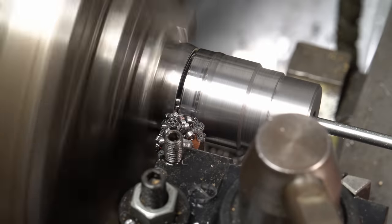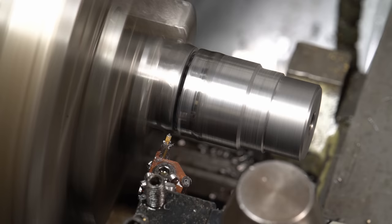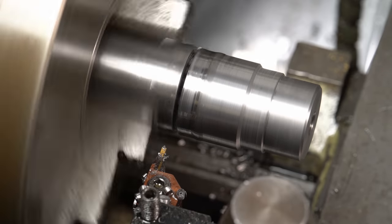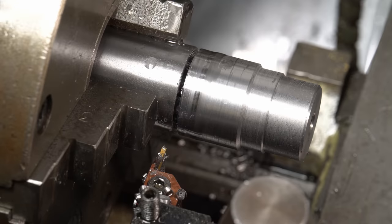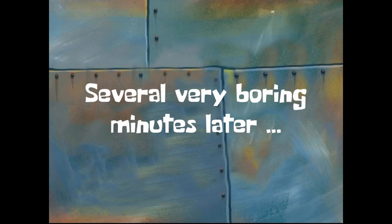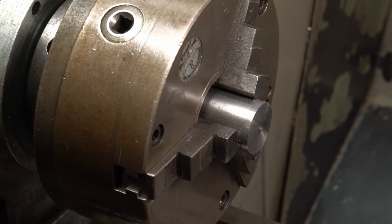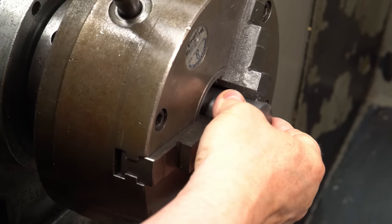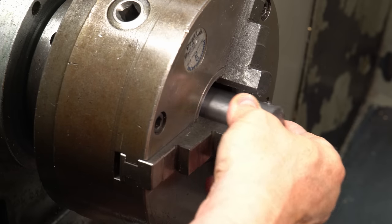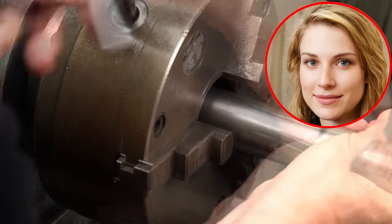I didn't check the measurement, and of course I ran out of tool before the cut was finished. So I laid a board across the lathe bedways and put the Colchester gearbox to 22 RPM with the power off and used a hacksaw to finish the parting cut by hand. Comedy length bar stop there.